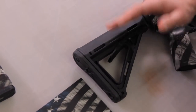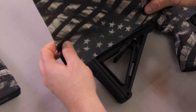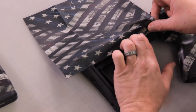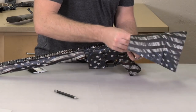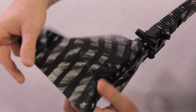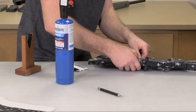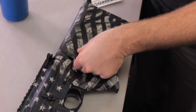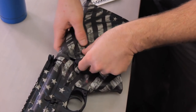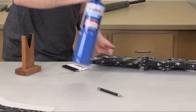For the stock piece, lay it up along here and work your way around the other side, hitting it with heat as you go. Lay it in making sure you're centered and have enough material to cover both directions, and look for a natural place to seam it — this little ridge right here works well. Set the material with your fingers. Once worked around the opposite side, start tucking the material and using heat to press it into place. Then, just like with the forend, press it where you want it, let it cool, and start trimming to get to the finished product. Make sure you're using sharp blades — don't be afraid to change them out. That's going to help you end up with a cleaner install and less of a fight.